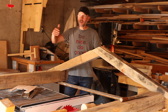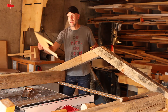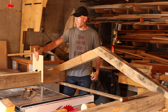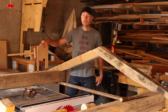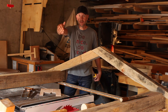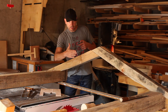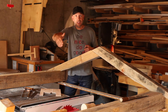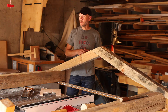The two outer rafters are in place, the pockets are cut and ready to go. I made a template that looks like this so that I can just slide it over the wall plate to see exactly what the shape of the pocket is going to be. Next up, we're going to do the middle one right down the center, then we have one that goes right in line with the front wall, one right in line with the back wall, and then that'll leave space for the remaining two to divide whatever space is left over.